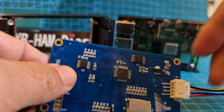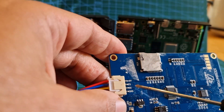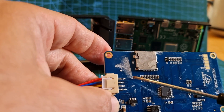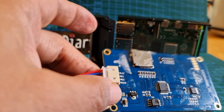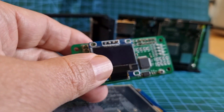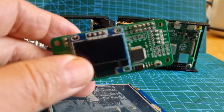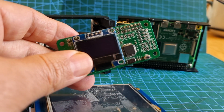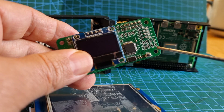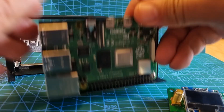On the actual screen they're marked: five volt, TX, RX. If TX is blue, then where it connects onto the actual hat, blue goes to RX. So you get the idea — TX and RX are swapped between the screen and the hat. Eventually we've got this screwed in here — it's a metal case.